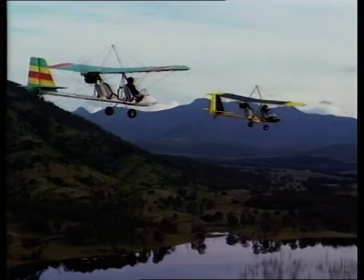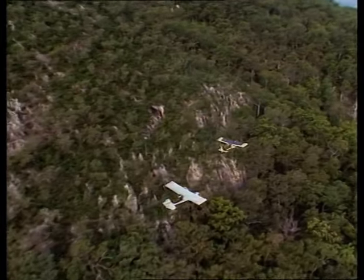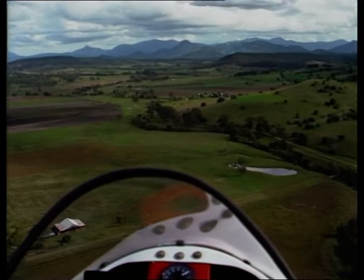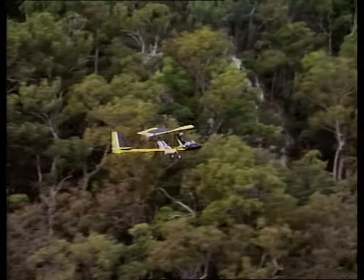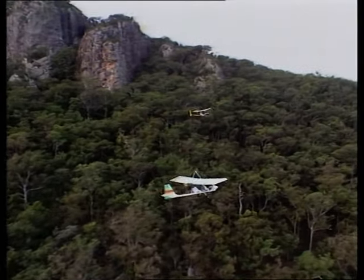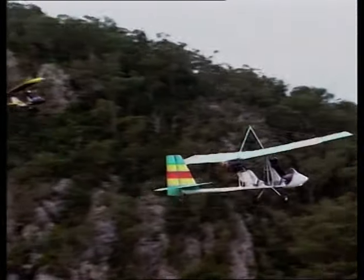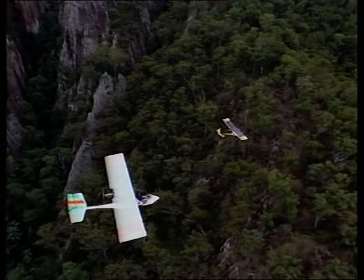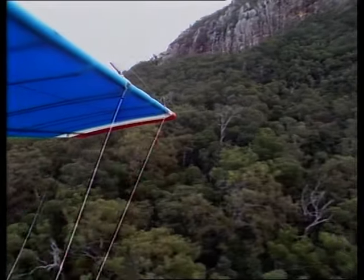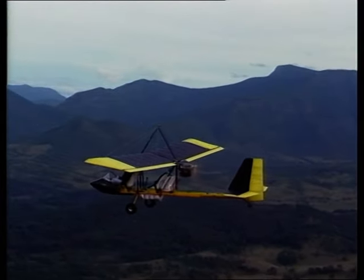This tape is being made for people who operate these engines in remote areas, suggesting a fairly hostile environment with dust, dirt, sand and grit. We can't stand any restriction in the fuel system - we have small openings in carburetors and fuel pumps. Restricted fuel filters cause a restriction and leaning out of the fuel, excess temperatures resulting in piston seizures. There are preventatives that the owner can do overnight by putting covers over various apertures that are open to stop these things getting in from natural occurrences.